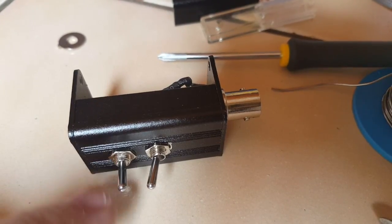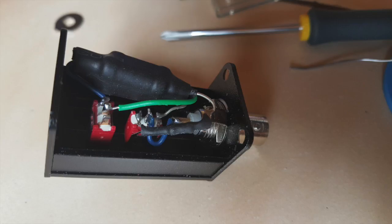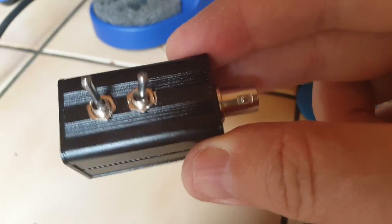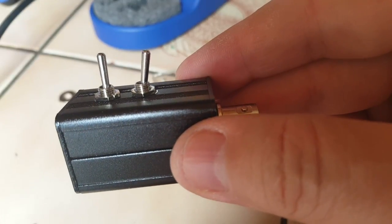The top switch will be used to switch between the 274 ohm and the 150 and 50 ohm pair, and this one is switching between the 150 ohm and 50 ohm load. I just found out that these switches have an internal resistance of about 7 ohms, so that doesn't work.